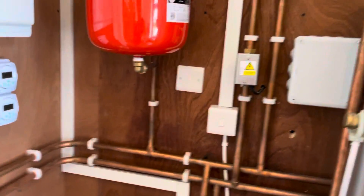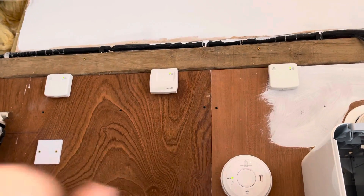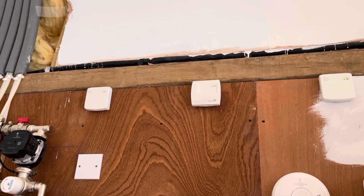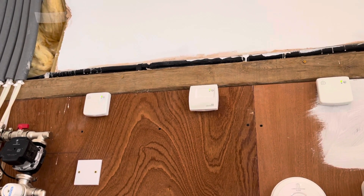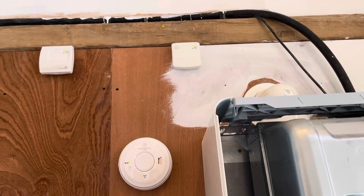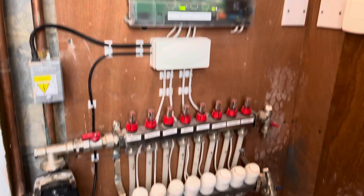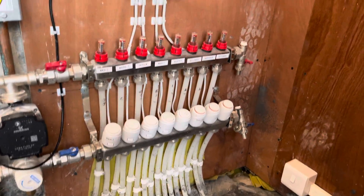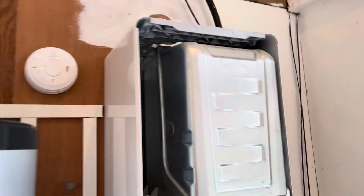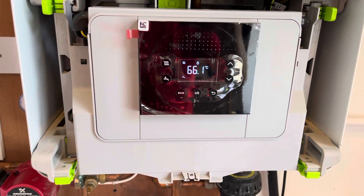I've managed to get it all up and running. It's not perfect — I'm going to have to come back and get the hydronic side done properly, because it's rubbish. But the control side is now working perfectly, as you can see. That's the boiler demand relay there. This is one of the Centerbrand stats they had — I've used the relay box, the BDR91, which is a rebranded OEM Resideo version of the relay. They make this for Centerbrand. It's been a fun one — took a whole day to do it all. I've tried to be as neat as I can, and it's a hell of a lot better than before. We now have controls and a boiler that works — this has gone to higher temp for hot water recovery and the heating is running at a much lower temp.